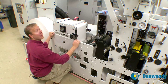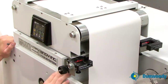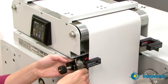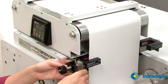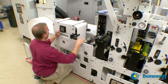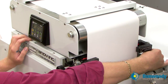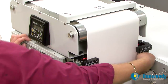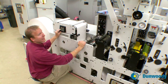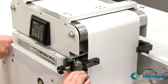The next step to the web guide setup is placing the web guide sensors in the correct location. This is done by placing the web guide in servo center again, selecting a web guide by pressing the web guide select key, and moving the web guide until there are no arrows indicated on the web guide setup interface. Once it is located in the proper location, tighten the screw. Press the web guide select button again to select the other web guide, move that web guide so there are no arrows, then tighten the screw. Press the web guide select key a third time to select both web guides and place the web guide in automatic. Now you're ready to set up for the ink.